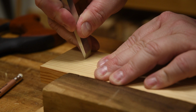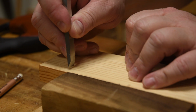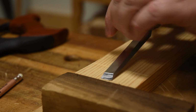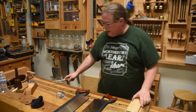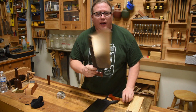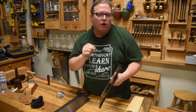And when you get close enough and deep enough with those slices, what happens to the fibers in the middle? They just pop out. Okay? The other one is taking the chisel and making slices like this. It cross cuts the fibers and then planes the shaving out. So in essence, I have two saws, one configured as a cross cut to go across the grain, and the other configured as a rip cut to plane down the board and slice it out in order to get the work done quickly.